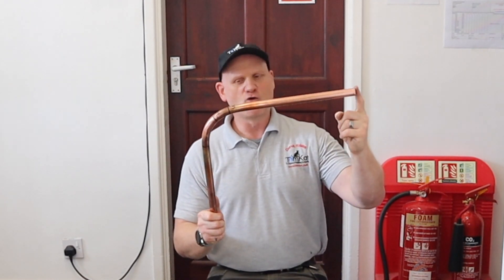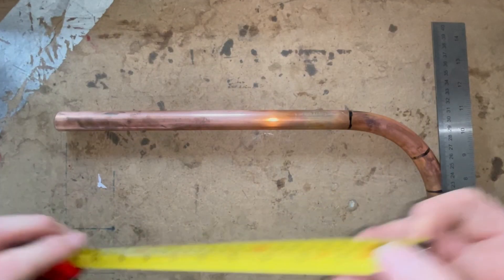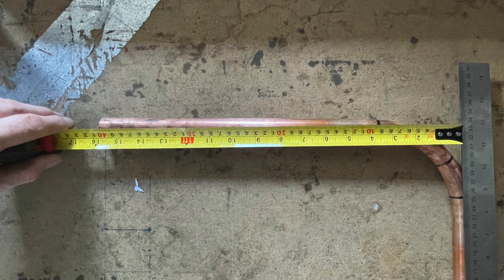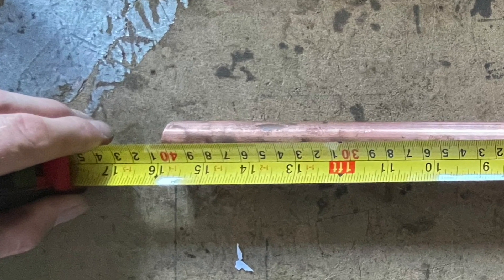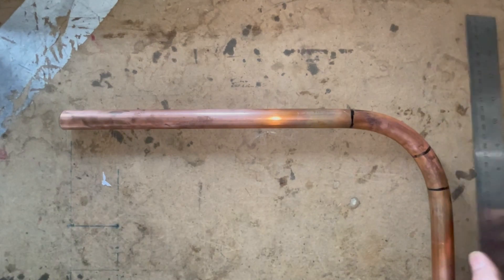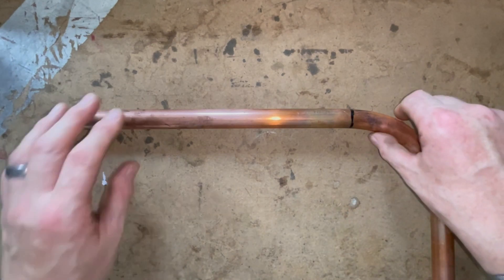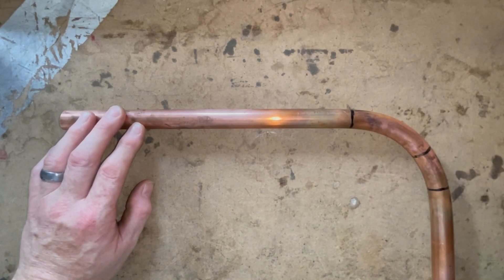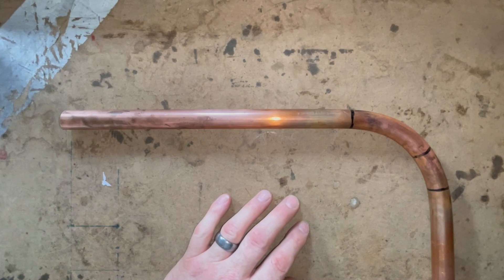Are we 400mm from the end to the centre? Let's find out. I have got my set square set up — putting it on the edge, you can clearly see we are bang on 400mm to the end of our pipe. The bend is perfectly formed in our bending radius. You can hardly see any ripples — you can feel them slightly — but if anybody brought that to me under assessment, how could I fail that? That is the perfect 90 degree bend bent with a bending spring in 22mm copper tube.